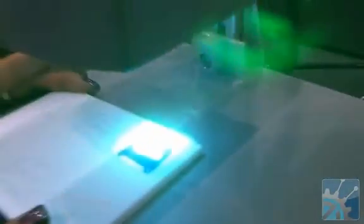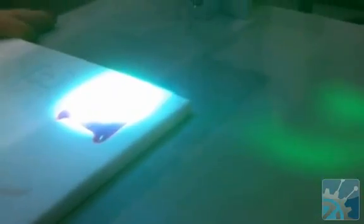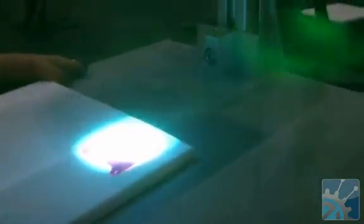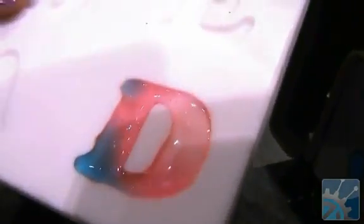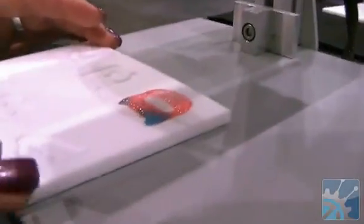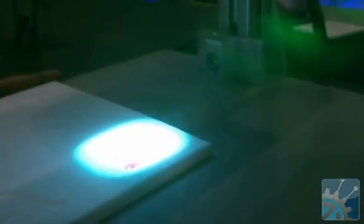Now, as you can see, it's starting to cure because of the transition from the blue to the pink. The front side of the D is still blue. And as you can see here, I'm going to pull it out — this did not get proper exposure. So this is a validation to the customer that their process is not having a complete cure. So what we're going to do is put it back under here and expose it until it goes pink.